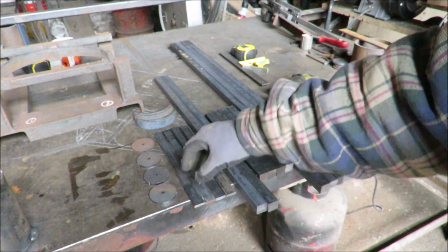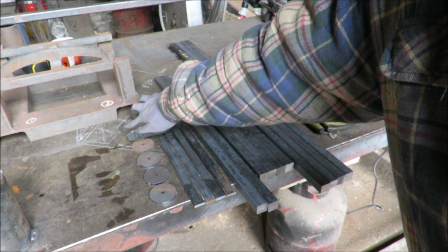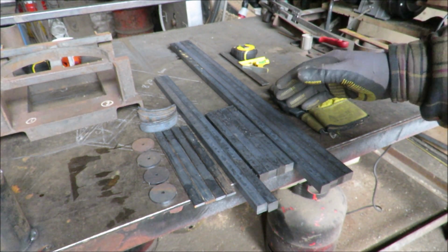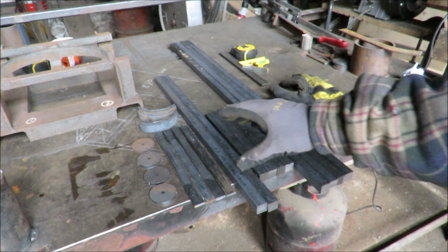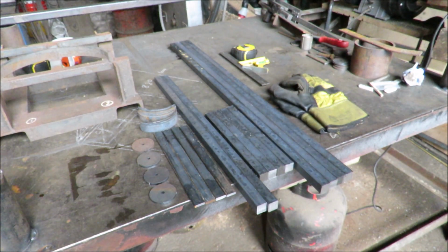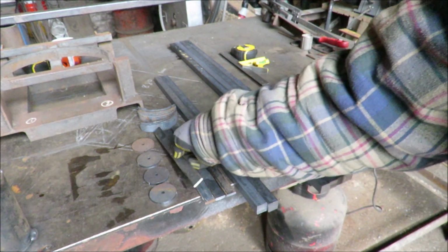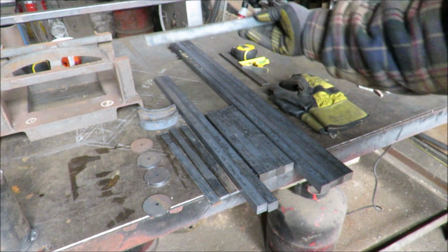These bits here, this is our second rung. I don't know if you can catch that on there, but that's our second rung. It doesn't need to be structural. We've got enough structure in here already, but it's got to look good, and this is going to hold. It's going to support the base of our little plaques or mounts we put on there. So I've gone for something lightweight. It's 5mm. Have it on its face like that, so it looks in keeping with the same thickness